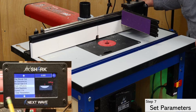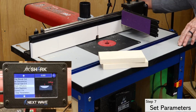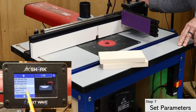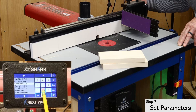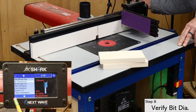Setting the offset determines how far the center of the slot is located from the edge of the board. I'm centering the biscuit on this board, so I'm entering 1.75. Next, select the size of the biscuit you're using — I'm entering 2 since I'm using a number 20 biscuit. The bit diameter shown here is carried over from what I entered earlier, but it's important to double check it here before proceeding.